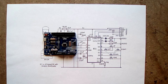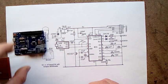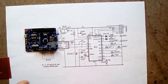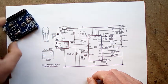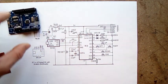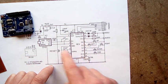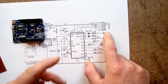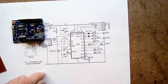I've got a couple of bits and pieces from the basement and pretty much everything I need. There's very little to it — all it needs is five push buttons and either an Arduino Uno, Leonardo, or whatever Arduino board you have. You can also do it with just an ATmega328 chip, but then you need all the extra bits on the schematic. With just the Arduino board we can bypass a lot of that. All we need are our push buttons going to the various points, our audio and video out, and we can also connect up two paddles controlled by 10k potentiometers.